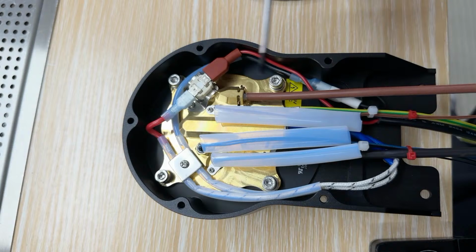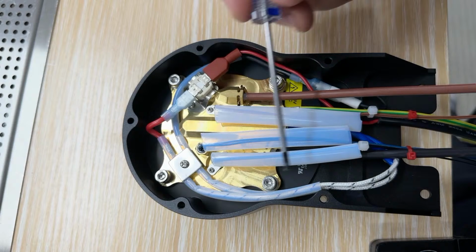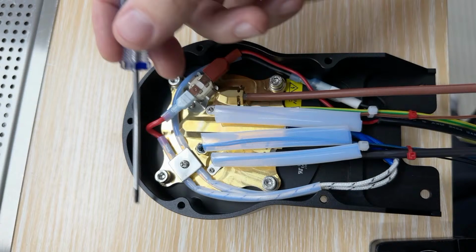This is one of our secrets for why we can start making espresso so quickly: we only need to heat up this path right here, not all this. Not only does it let you start up faster, but it also means that you're not going to burn yourself as you touch here. It also means we don't waste electricity heating and radiating to your room all this stuff.